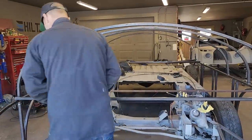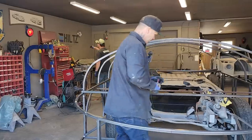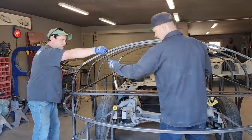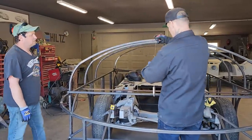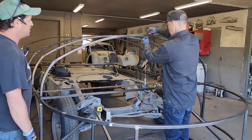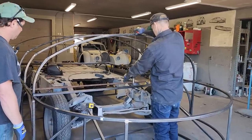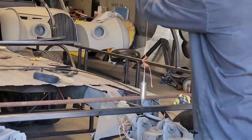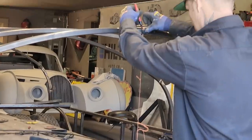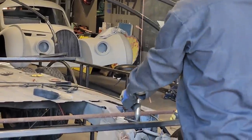We've got that on the edge there. That's fine. Will you get the plumb ball, Doug, please? It's up there on the top of that toolbox. So that's the center, I'm saying, of the roof rafter. I'm going to put the plumb ball on there, get the plumb ball to hit, and then I'll just mark where, that's what I'm thinking anyways. Yeah, it's not long enough, but looks good enough to me. Close enough. I'm gonna call that center.